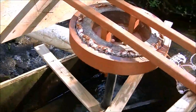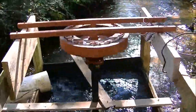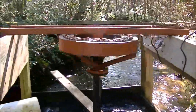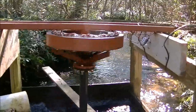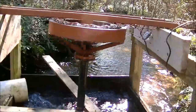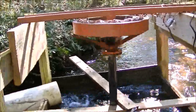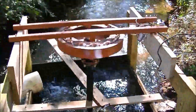I'm going to release the board in front of it and let you see it work. I just released the water, and you can see it spinning. I've got a little white dot on there so you can kind of see the RPM — we're around 170. That's about as fast as I've been able to spin it with my setup. I get 12 amps at about 30 volts. It's enough to run two refrigerators.